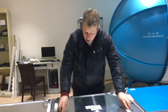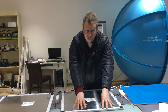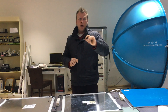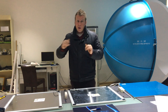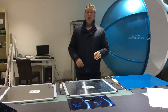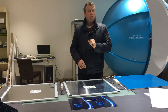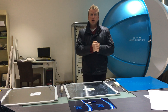With our panels, it's a quality aluminium frame, and we have two types — sheet steel embedded in a bigger aluminium frame, or a full aluminium sheet — two styles. They heat dissipate better. We use a thicker PCB and a 2835 LM80-approved diode, which has a much better deterioration curve. Some people might give you a five-year guarantee on a cheap panel — but have you asked them the L70 value on that? Not just the LM80 on the diode — I mean an in-situ test of that product to give you the full deterioration value.